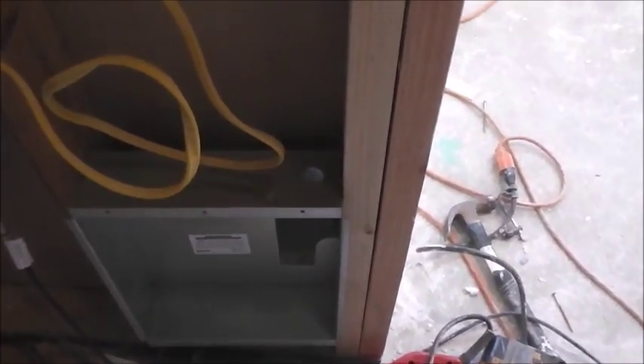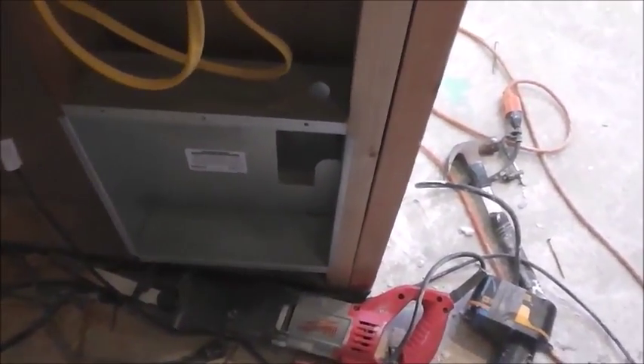I'm going to have that all installed and ready to go with the sheetrock right over top of it. Then going forward, when all the inspections are done, I'll mark very carefully from the floor and from the sides where the cutout is, taking into account any floor height. That'll expose the casing, and then it's just a simple matter of the wiring already inside and hooking the unit into the housing. It'll be a good finish unit — if somebody's taking a shower or using the toilet, they can pop that on.